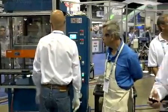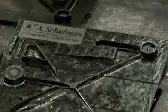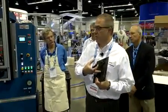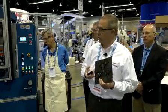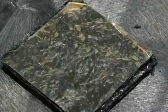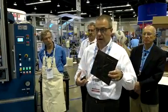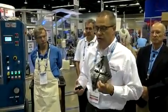The part we're going to be molding today is what we refer to as our torture tool. It's got a lot of complex geometry. The fibers will flow and fill all these complex geometries. You see how simple the charge pattern was that went into the mold — just a stack of five-inch by five-inch squares to fill out this geometry. The tool has multiple thicknesses, and we call it our torture tool because it's a difficult part to mold and get all these features in there.